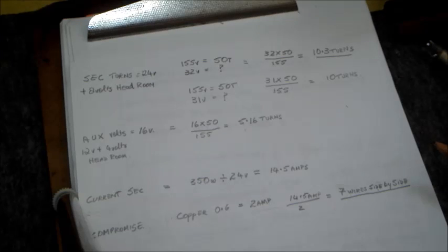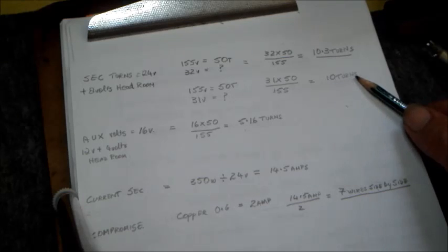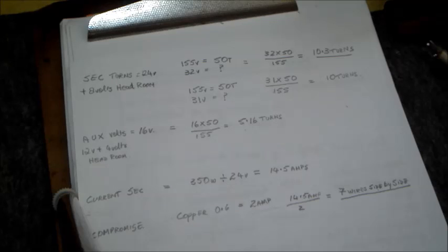So what are we going to do? Well, through experience, I have seen 5-volt windings in computer power supplies having a quadrifilar winding for handling 5 volts at 20 amperes. So having such few turns, all in all it's 10 turns, and the length of the wire itself is rather short. It would be less than a meter altogether. And having 4 of them at one go, side by side, the voltage drop and the current handling will improve considerably, and I'm going to consider that my windings is going to be a quadrifilar winding, okay, for the secondary turns. And I am going to explain how it's going to be done.